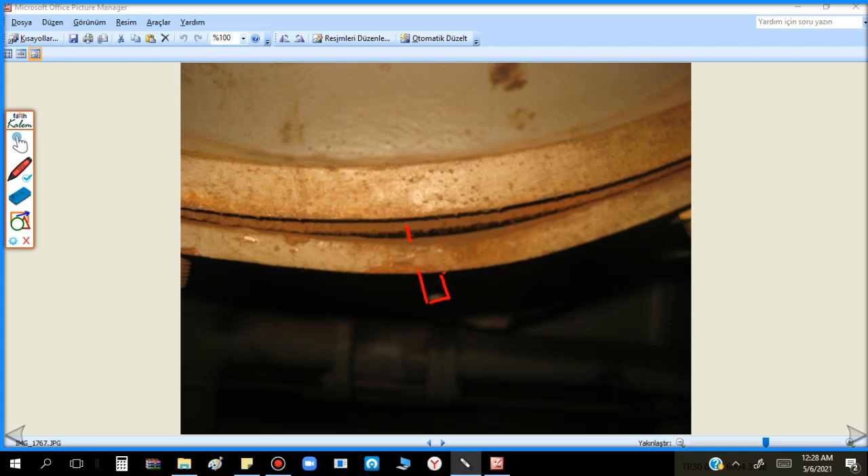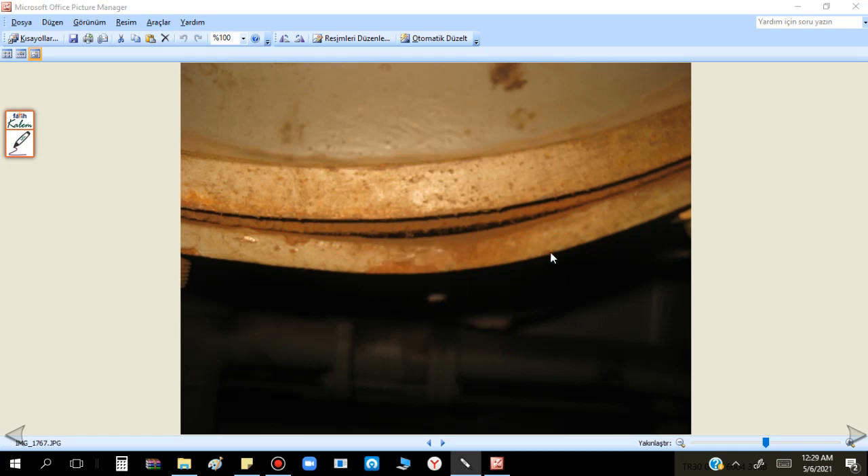This is the cause of the bolt problem. The brake lining has already become very thin and the disk starts to touch the bolt inside, damaging the bolt. The bolt is not exactly upright - it is shifted a little. With repeated open-close cycles, this bolt starts to deform. When you open and close, it will not be properly secured. This is not good, not safe, and has to be checked.